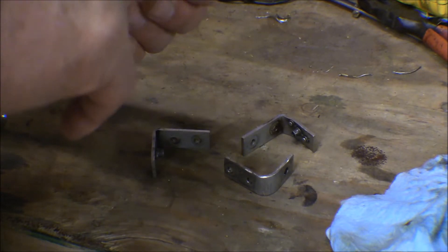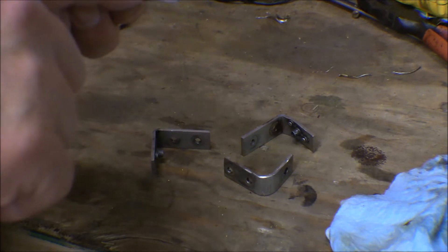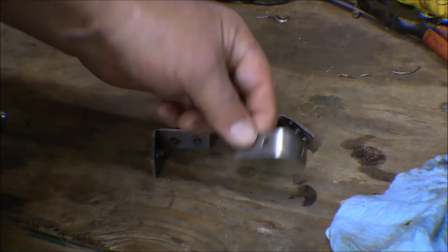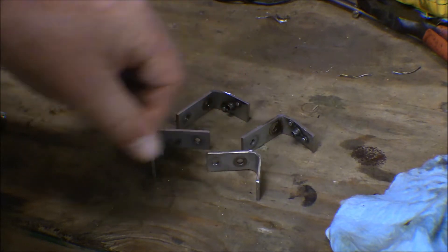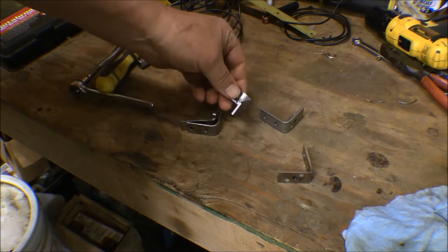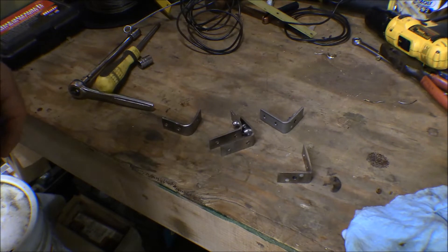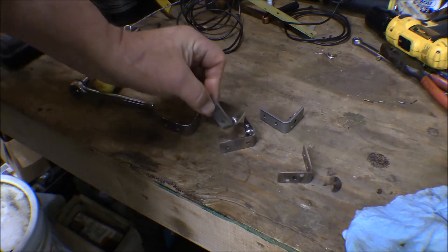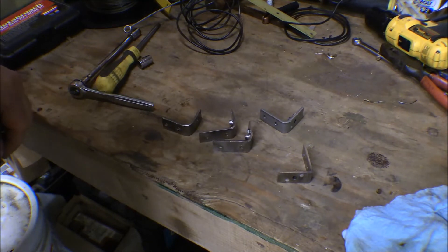It looks like these holes might need to be de-burred a little bit. I've also got nut plates on three of them here, but they're the fixed type of nut plates. I may take those off and put floating nut plates on there. One of these was cracked and was replaced, and it doesn't have a nut plate on it — I may put a nut plate on that one too. I took these brackets over to the shop, stuck them on the wire wheel, cleaned them up, and inspected them. These things are a little rougher than what I would have liked. I thought about making new ones, but there's nothing wrong with them — they're functional and still in good shape, no cracks, so there's no real point in making new ones just to serve vanity.